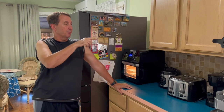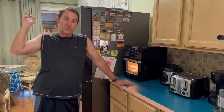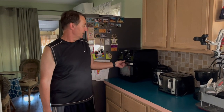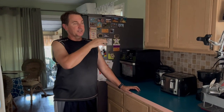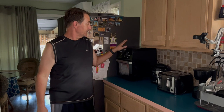So I want to add a dedicated arc fault circuit to this one and see if it stops the tripping. Because right now this one is covering this outlet, the fridge, the lights in here, and porch lights. This is what it looks like when it trips — the lights go out, the appliance goes out. If you're in the other room, you may not notice that the power went out until you come back in and the lights and everything are off and this thing stopped preheating. So I'm going to run a dedicated circuit over to this outlet. I would rather have just this trip and the lights stay on.